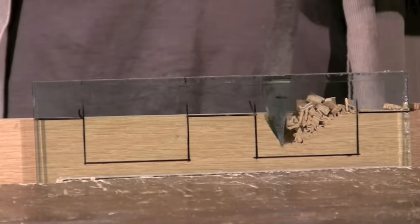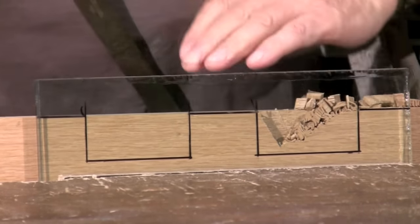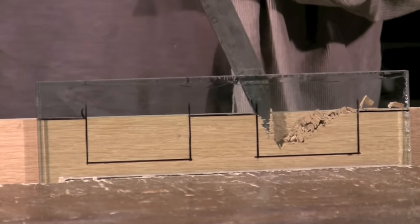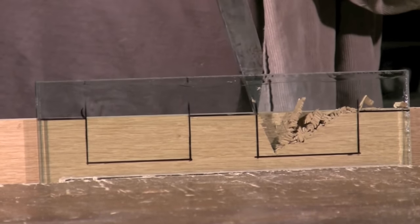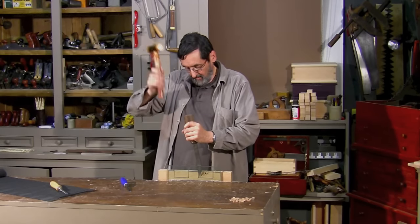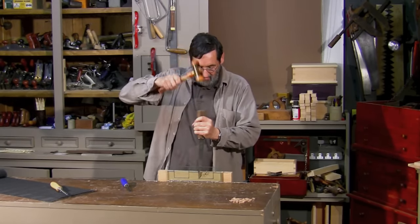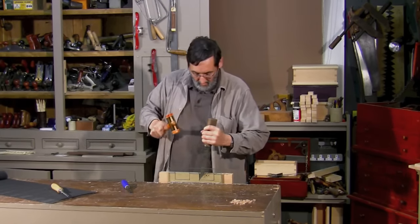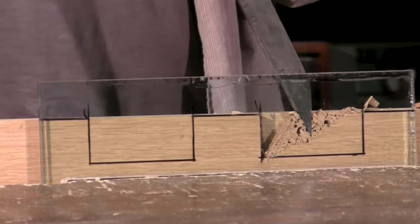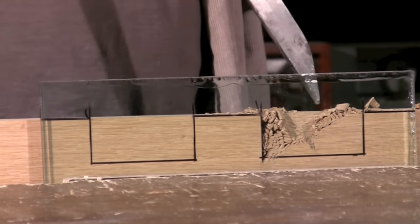Notice that the bevel we're cutting here is the same as the bevel of the chisel. I go perpendicular — I'm right on the edge, about a sixteenth from the edge, so I can lever. When I've got this far I go with my chisel to follow the angle a little bit less. Generally you sharpen your chisel with a bevel of about 35 degrees on the cutting edge. Notice here the bevel of my chisel is perpendicular, so I lever against the bevel.